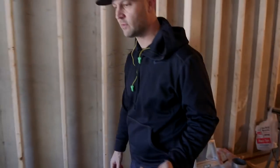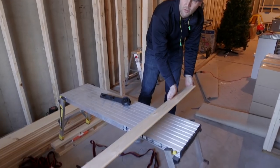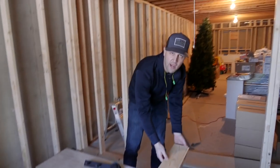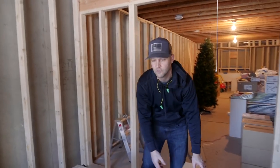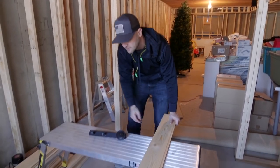Jeff and I already picked out the boards we wanted, making sure they're really straight. I brought them into the room for a couple of days to reacclimate to the humidity levels in here, so we should be good. We're going to lay those out tongue-and-groove style — here's the first one.